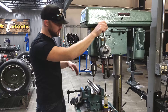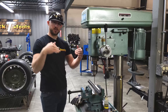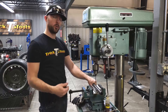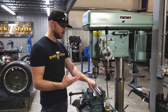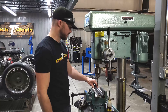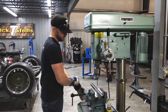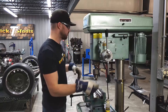At that point you get your tube set in and you don't have to clamp it, because when you're drilling it's putting pressure down in that V. You obviously want to just keep a hand on it to hold it from vibrating, but you don't have to clamp it down in order to drill through. Once you get it set up you can use whatever size drill bit you want to drill through.